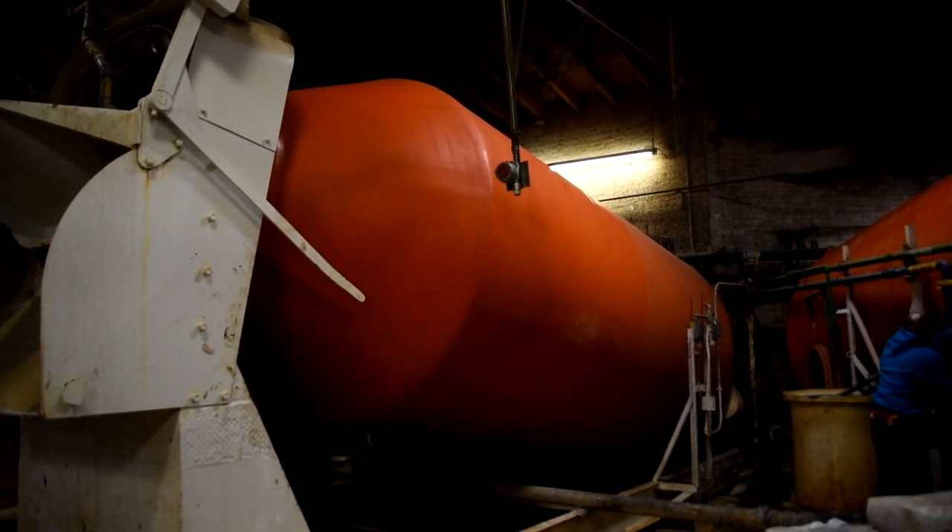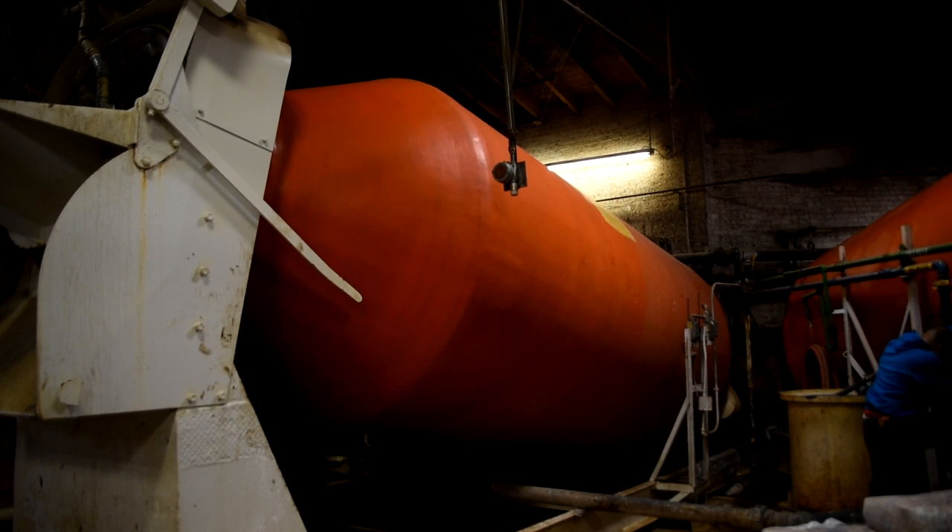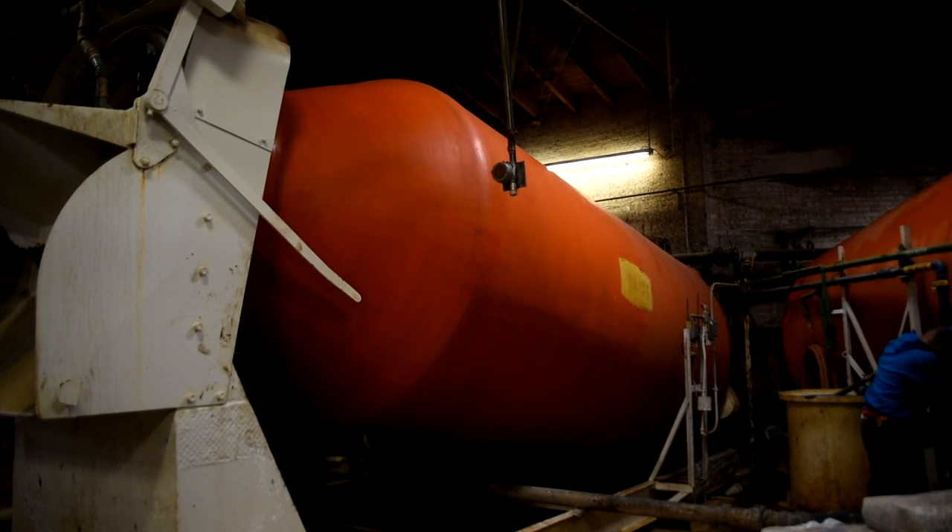Your goal is to tan it, and right now everything is working against you. That's the first phase: soaking. The first soak is just water. The second soak you start introducing detergents and biocides. At Horween, the soaking process is done in vessels that sort of look like big cement truck mixers.